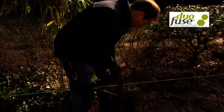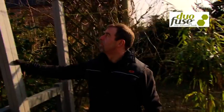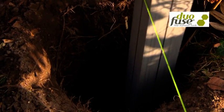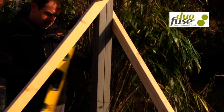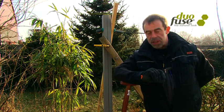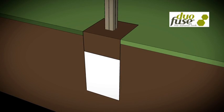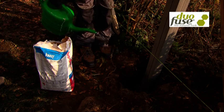When placing the fencing in the garden, dig a hole and put the posts into it, using long wooden battens and clamps to ensure the post remains vertical until the concrete has set. Each hole has to be filled for two-thirds with stabilized sand, concrete or fast-setting concrete. When the concrete has become hard, I can fill the rest of the hole with hard-pressed soil, so that I can sow or plant afterwards.